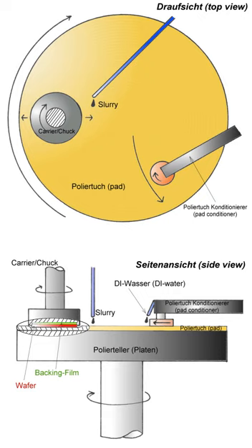The dynamic polishing head is rotated with different axes of rotation, i.e., not concentric. This removes material and tends to even out any irregular topography, making the wafer flat or planar. This may be necessary to set up the wafer for the formation of additional circuit elements. For example, CMP can bring the entire surface within the depth of field of a photolithography system, or selectively remove material based on its position. Typical depth of field requirements are down to angstrom levels for the latest 22 nm technology.